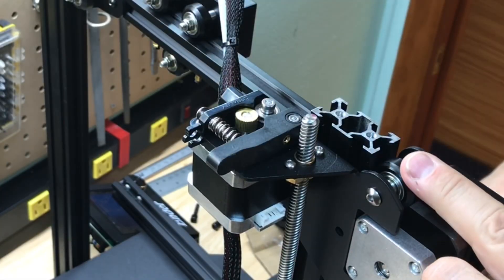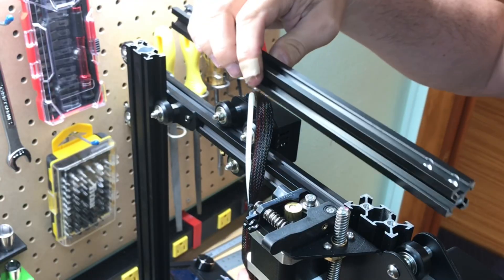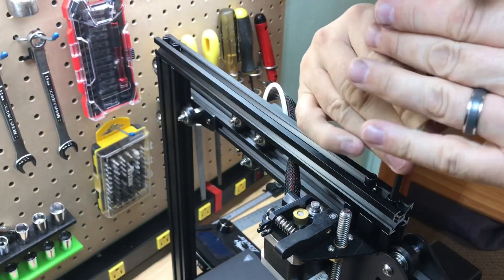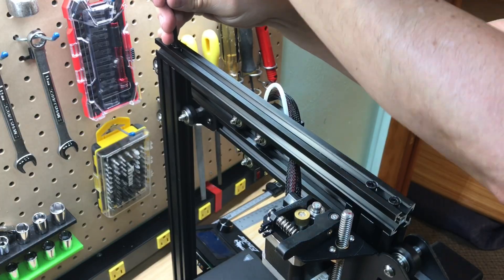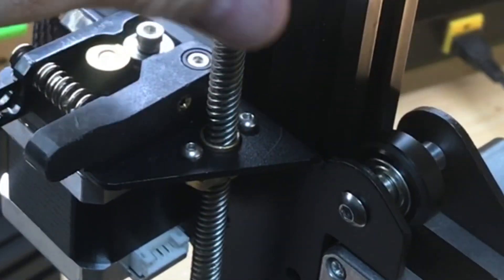Move the carriage all the way to the top until the wheel is just below the beam. Then grab the M5x25 screws and the top bar. Make sure the wires are under the top bar, not over the top. Position it at the beam and put the four screws in — I like to tighten one side and then the other back and forth. Make sure the cross beam moves up and down smoothly from the bed to the top.